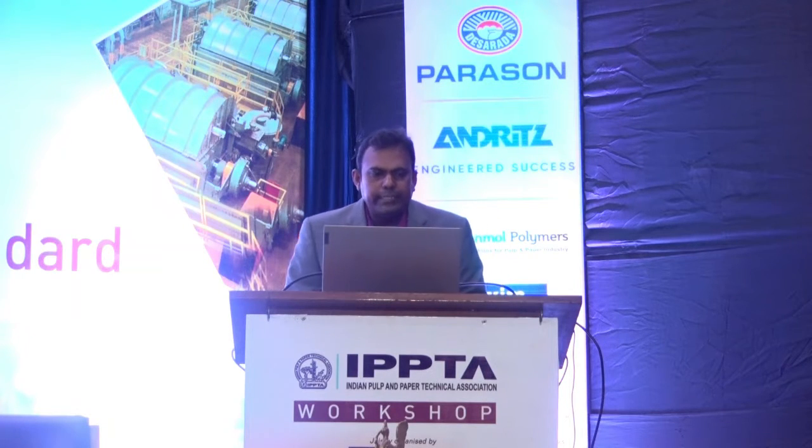Pith also reduces the yield, and it will also reduce the strength of the paper. So that's why pith plays a major role in the cooking process for bagasse. We have to remove the pith as much as possible in the bagasse. If we talk about silica content, silica increases wear on the machinery, and it also increases solid waste and the handling cost.